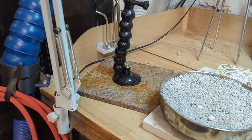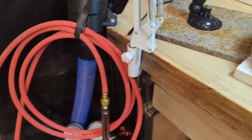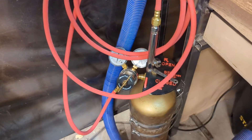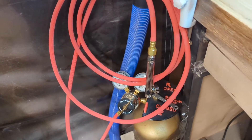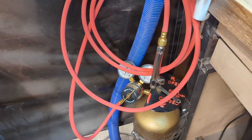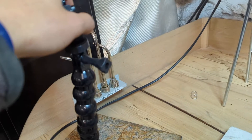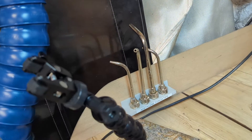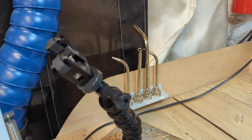At the jewelry bench, in addition to propane and butane, which are also useful heating tools, we have acetylene, which has a few benefits over propane and butane. One is that it gets hotter — it gets to about 4,700 degrees Fahrenheit — and two is that we have these different tips for it so that you can make really small pinpoint flames or larger flames for melting larger amounts of metal.